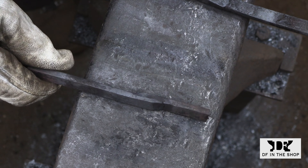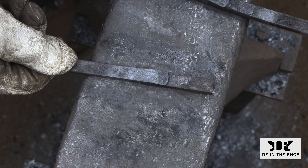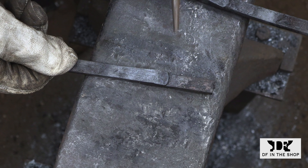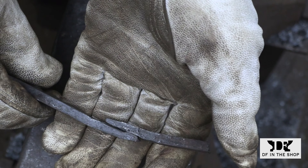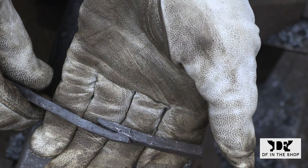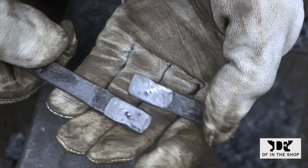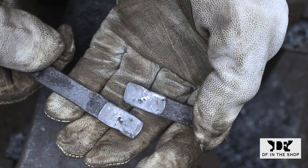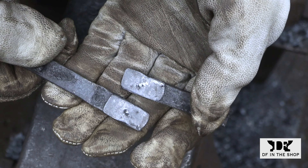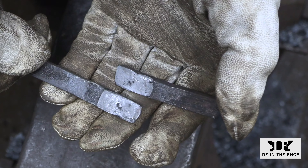So this time the weld did stick but I could tell there wasn't the same amount of grab that I had in the first two welds done under ideal conditions. Here's the sample for this weld and you can see how the ends of the weld — the scarf joints — are still a hard line. They should be blending into the rest of the bar even at this stage. So there is evidence that there are problems with this weld. The bend test shows it took absolutely no effort to break it. The two dots in the center that look like center punch marks are actually the only area where there was any metal transfer — those two dots were actually holding the weld together. Everything else there was clean metal but they just weren't sticking.